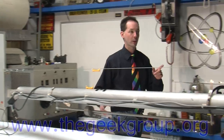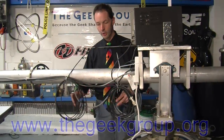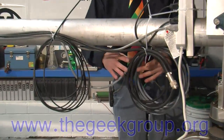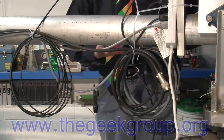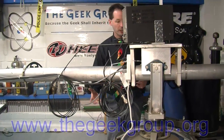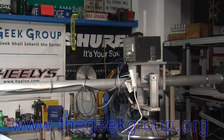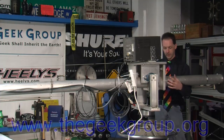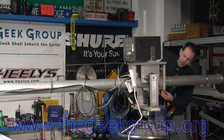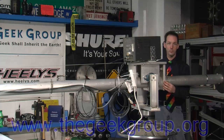On the other end, this is where all the controls are. We've got the usual cables hanging out here — this is stuff like video feedback, power, and control. These all hang back here to keep them out of the way because this is a giant gimbal. It's all just made from aluminum — one-inch thick aluminum stock. It's a simple mount; we threaded down under here and made some clamps. This was all done before we had CNC, which made it pretty difficult.